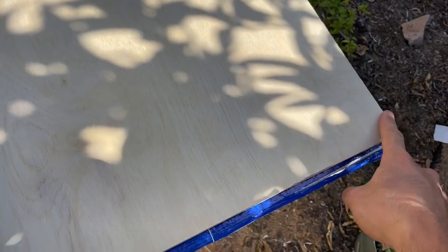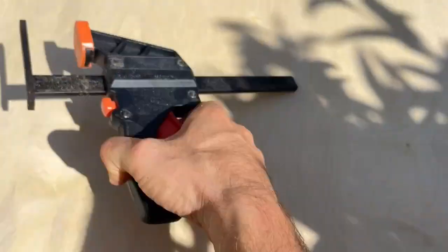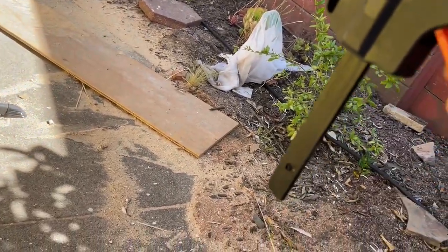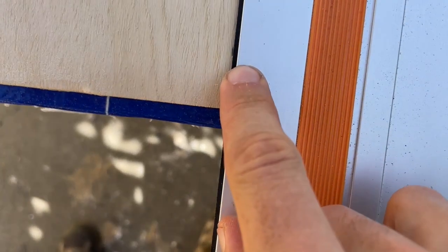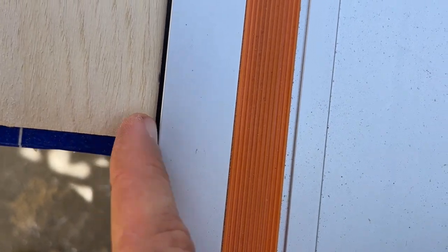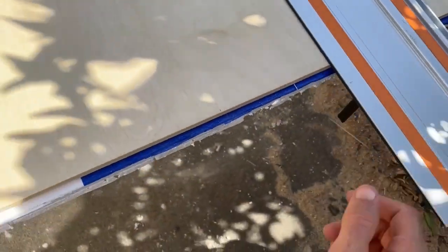Going to the other side of the board and doing the same thing — referencing off of this side to here. I've got my mark at 52.9 centimeters. I highly recommend double-checking stuff. You're just going to line it up so that it's right on the center. Clamp goes into the track. Now the blade is going to be removing material to the left of here, so the center of my mark is going to be preserved, which is the 52.9 centimeters.